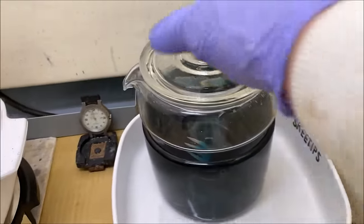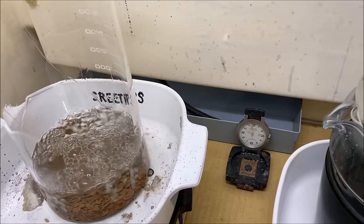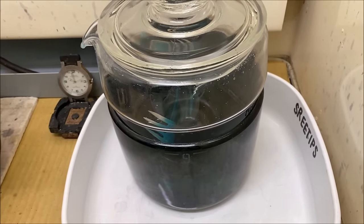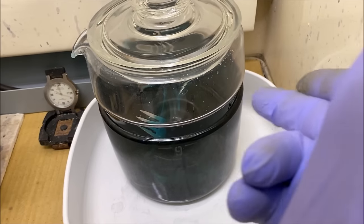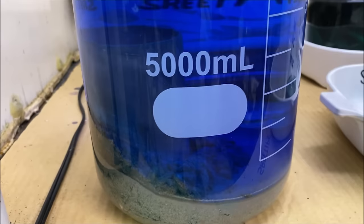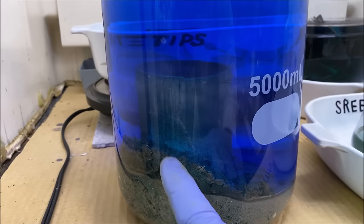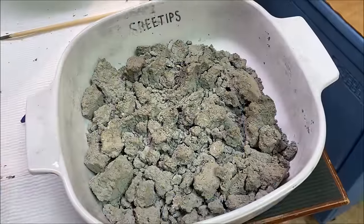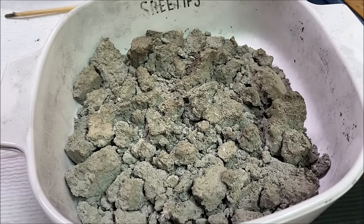We emptied it out into our silver jar, and in here, any excess nitrate that remains in our solution will get consumed by the sterling silver in there. That solution is full of silver. I wouldn't want to even venture a guess, but there's quite a bit of silver in this liquid. I'll filter out all the solids, and then we'll cement the silver out of it with a piece of copper, like we've done here. The silver comes out of solution onto that copper and falls down here as silver powder. I rinse all the blue liquid off of that silver powder, and then I dry it out. This is cement silver that's been rinsed and dried out,